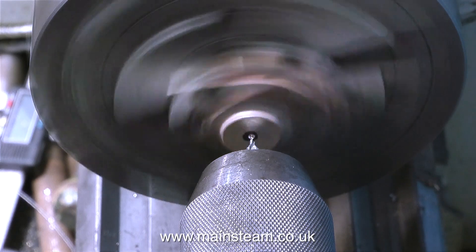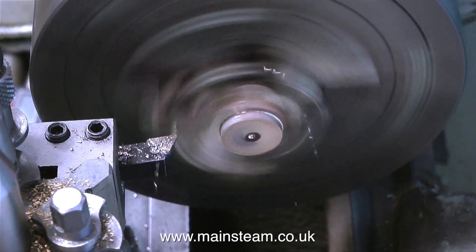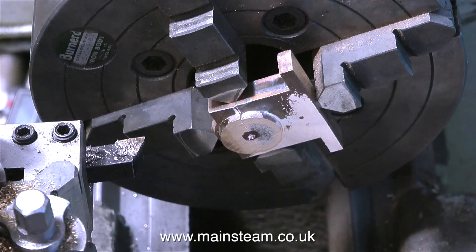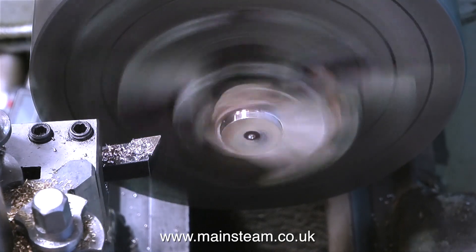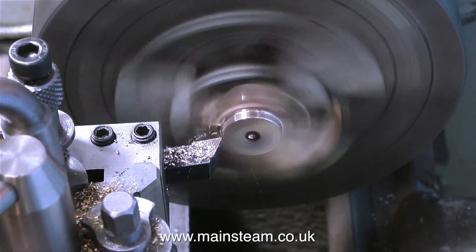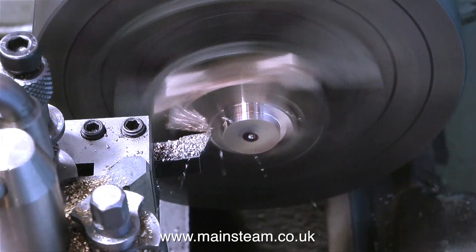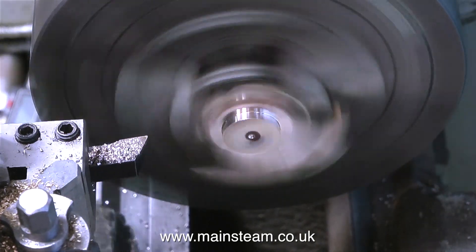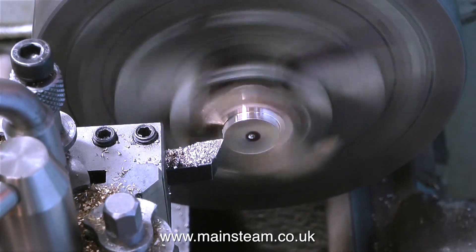The drawing just shows a 7/16ths hole through these blocks, which is what it's supposed to be for the crankshaft. I've used a half-inch diameter crankshaft, so if I wasn't using oilite bushes, I would be going through the middle of these bearings with a half-inch reamed hole. But now I've decided to use the 5/8ths oilite bushes, then obviously the hole down the middle of the bearing block has to be 5/8ths of an inch too.